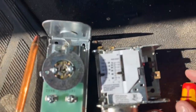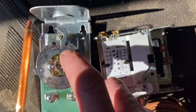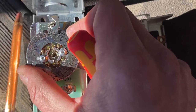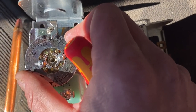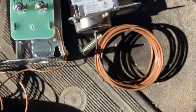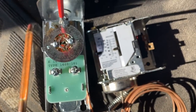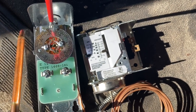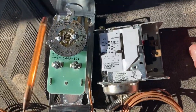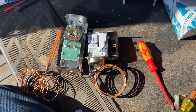On this style of control, this little arrow is your temperature differential. Each line is two degrees, so that's out at about a five-degree differential. You can get your screwdriver in here on this little adjustment and open it up — if you see the arrow move, that's your temperature differential. We usually leave them down; on the first one it's about three degrees.